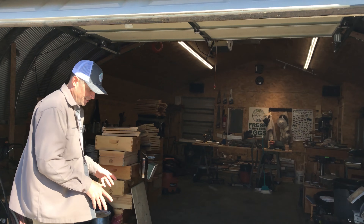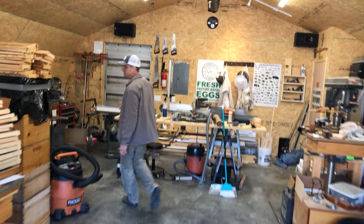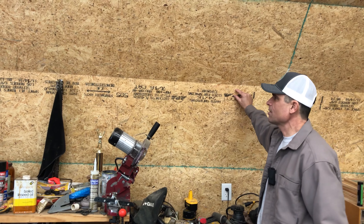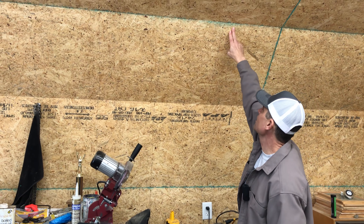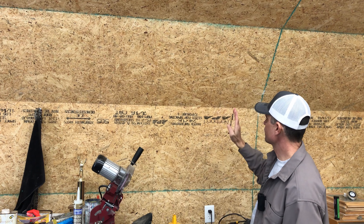Alright, day three. It's Saturday, time to get in and do a little bit of work. We're going to cut — I've got some pieces of plywood and these are just the really cheap furring strips that you can get in the back of Lowe's for about a dollar something a piece. We're going to rip the plywood into some shelves. What we'll do is tack one of those strips along underneath here, set the shelf on this, go up here and attach another strip, cut it at an angle, and attach it here — and then be able to drop down strips to the front of the shelf as a support.